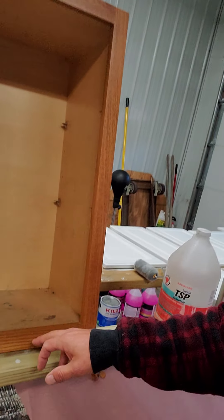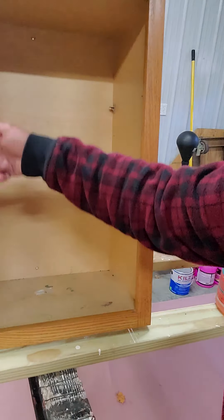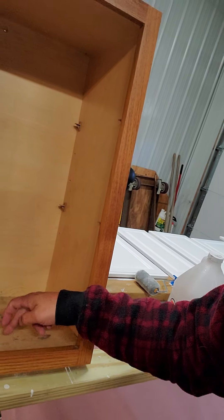Once that's done, I'm going to paint these cabinets. I still need to wash down the edges, then I'll run blue tape — the reason for blue tape is it's easy to pull off, so I can hit the edges fast without getting paint on the inside. If you get paint on the inside you might as well just paint the whole inside. Those are the steps: wash with TSP, hit it with a primer designed for cabinets, and make sure your paint is designed for cabinets. For exterior doors, make sure to use a good exterior paint.